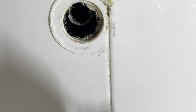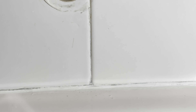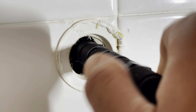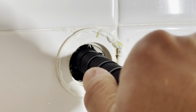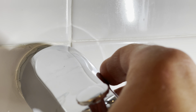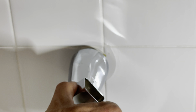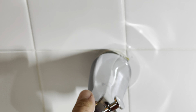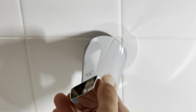Let's test fit it. Had this been a slip-on, this would have been a lot easier — we could have just loosened the set screw on the bottom and slipped it right off, and the pipe would have been right here. However, this is a twist-on style, so let's get this on here. Don't screw it on too tight — we're just test fitting. If you feel too much resistance, turn it left until it clicks onto the threading, then continue right. See how it's on an angle? That doesn't look right, so turn it left — there we go.